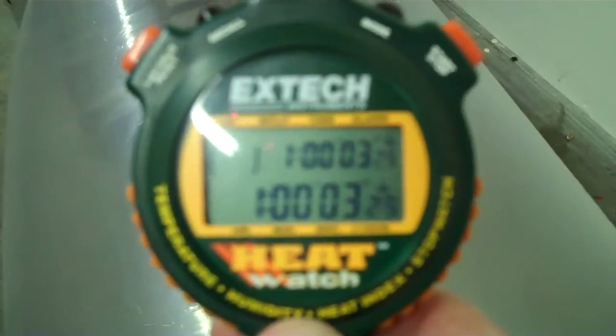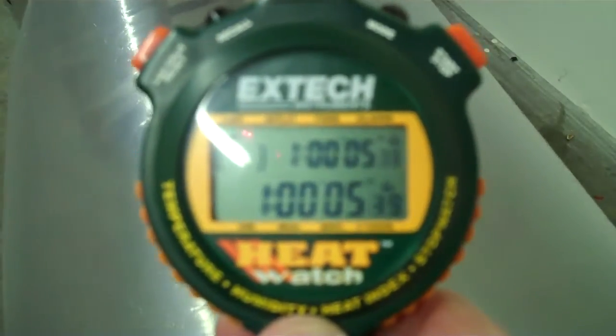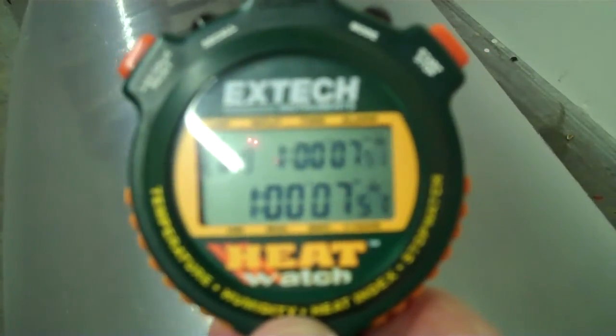We're back out to check the dehumidifier, and it's right at about an hour. The dehumidifier is working great. It's producing about 38 GPP, and it's about 89 degrees. You can see the water level in the pot there, and we're going to continue on.